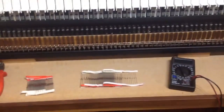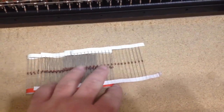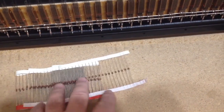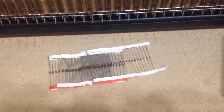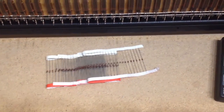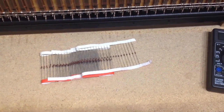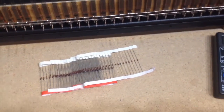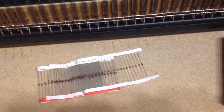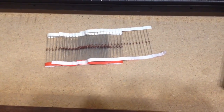The next thing we need to do is fit our diodes to the keyboards. These are the diodes — they come usually on a strip like this. You can buy them in small quantities, but you really want to buy a decent quantity on a strip; they are much cheaper that way. You can buy them from companies like RS Components or Farnell Electronics. These diodes have a type number, and these little ones are the 1N4148 — they're very, very common and turn up in absolutely everything.